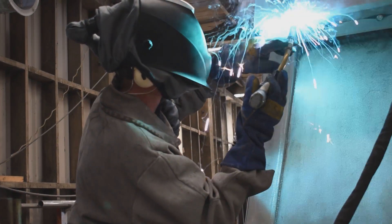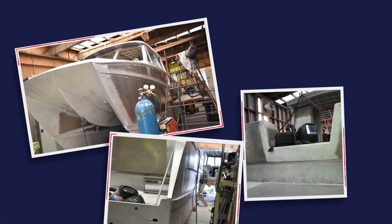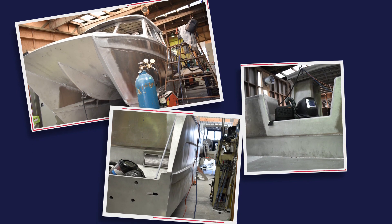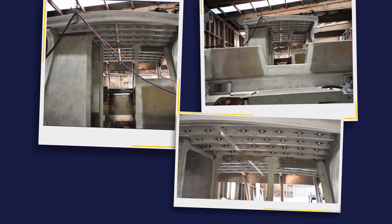So if you're welding all the time doing all that welding, you need some ventilation protection while you're doing it really. We do what we can with fans and ventilation but there's nothing like having cool clean air right at where you're breathing, and it makes it a lot better. If you put a filter mask on, it's very hot on your face and you can't breathe — you build up heat very quickly when you're welding.